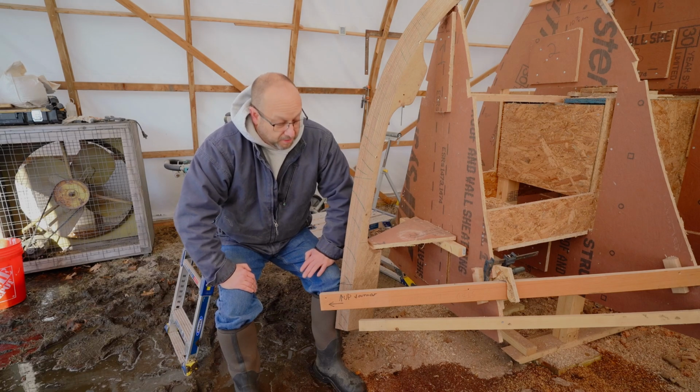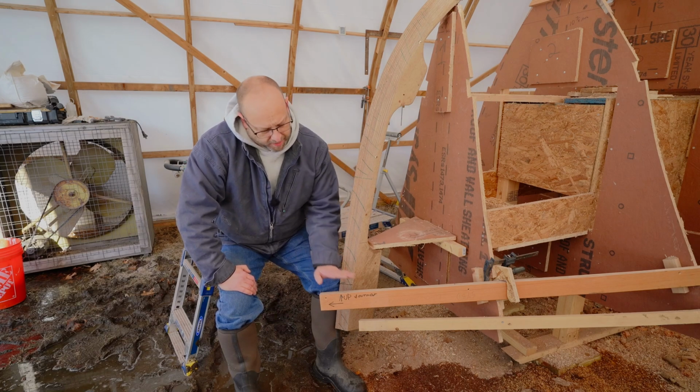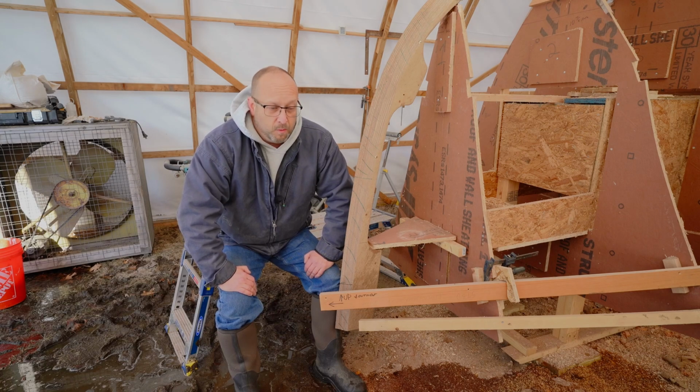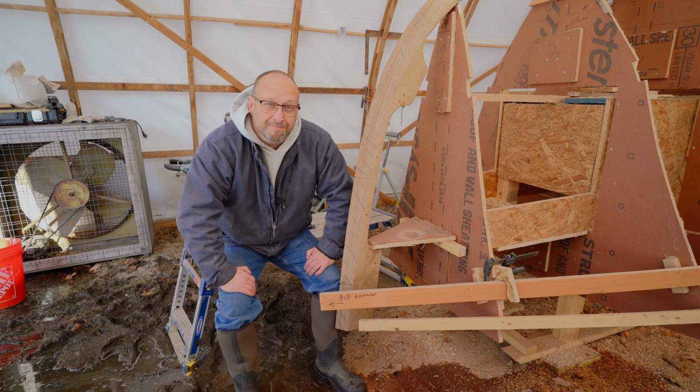So, seeing it now, I think I'm going to call an audible and change direction and do some cutting on the front end here of the shear clamps so that they essentially wind up being laminations and will be able to give me the twist that I need and the curve that I need without terrifying me that I'm going to explode them as I try to bring the ends together.